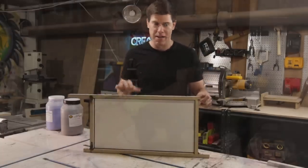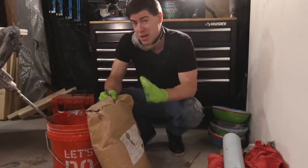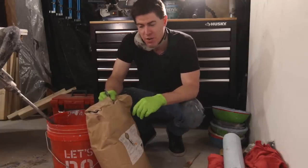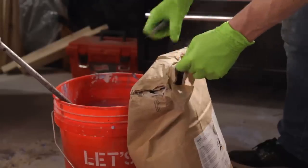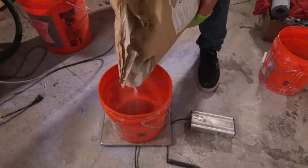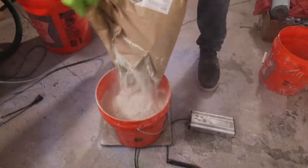For this I'm going to use a Fishstone GFRC mix. GFRC can be poured super thin and has a ton of strength benefits. I'm going to use a scale to measure this out — about 20 pounds of mix. I probably won't need that much but I always like to mix a little extra. You really need to mix GFRC evenly, and in order to do that you're going to want a dedicated concrete mixer or at least a helical paddle on a drill, and mix in a bucket instead of a pan.